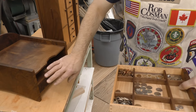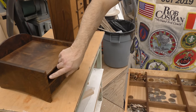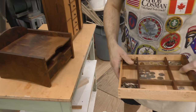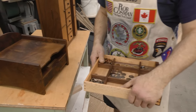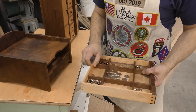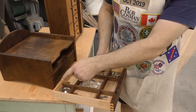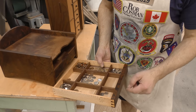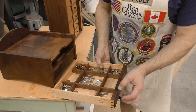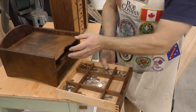When I say precise, I mean it just fits in the hole - you actually have to push it to get it in there, and it has to be as tight at the top as it is at the bottom. If you screw up, you go get another piece of secondary wood - not a big deal. Once you've got that done, you take that back as a template, lay it on your drawer front, and with a knife carefully mark the left and right side. Then on the shooting board you make that piece match the other exactly. Now both of them are going to fit that opening.